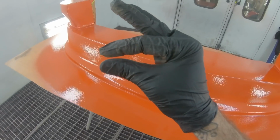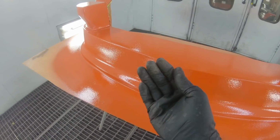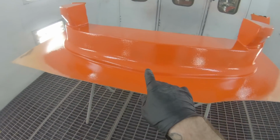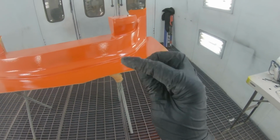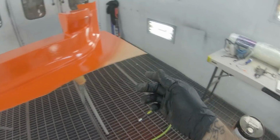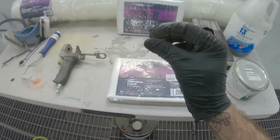Otherwise, you'll have little air bubbles in between. And then on the other side of your mold, if you start pressing or you use it a bunch of times, you can pop through, because this stuff is not going to be that thick. It's pretty durable, but you can always have small voids, air bubbles in the back of it that are not helping it. It's not reinforcing, like the entire point of adding all of this stuff is. So this stuff gets super close to it.